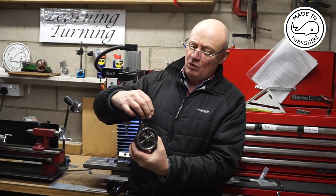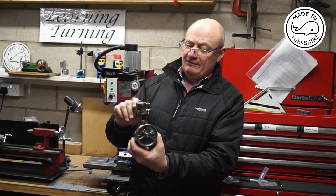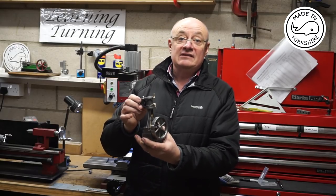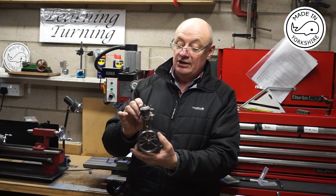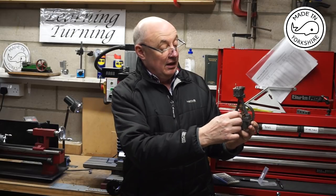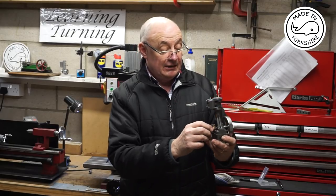I think I need some fibre washers or something for these drain cocks, just so they can be sort of nipped up into the right orientation. And I've decided for now not to drill the inlet and the exhaust ports until I've got some connectors, and then that will sort of help define what tapping I need to do. Apart from that, it's really starting to come together. I need to sort the eccentrics out and the valve timing, but we're getting very, very close.